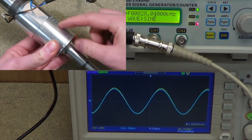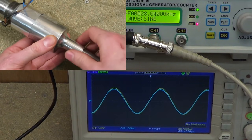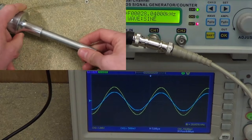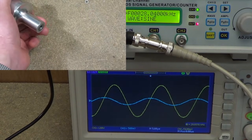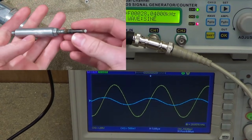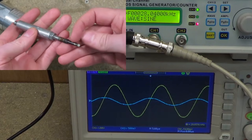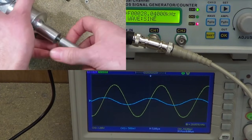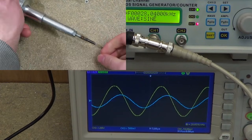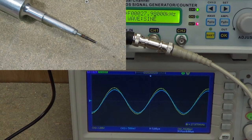That's the purpose of this ridge in the first horn — it gets sandwiched between two O-rings in a little clamp that I made up. And the last horn to show is this thing, which I made for trying ultrasonic soldering. It's a piece of aluminium bar with a piece of threaded rod acting as a soldering tip — this was heated with a small gas torch. Its resonant frequency is just under 28 kHz, so again it's a good frequency match.